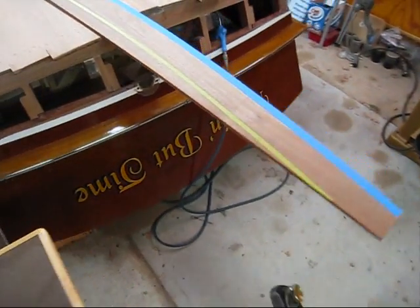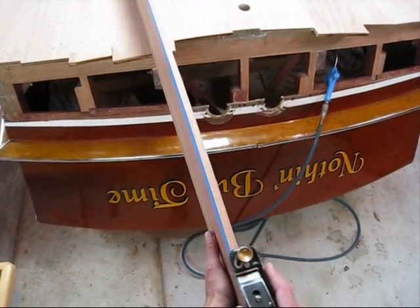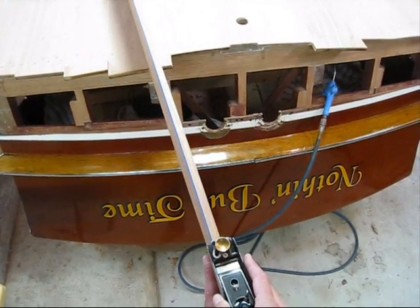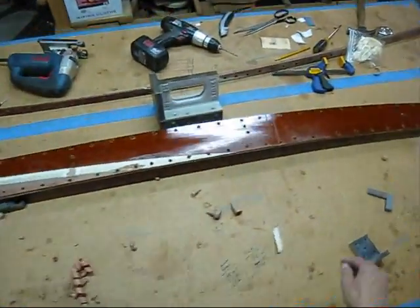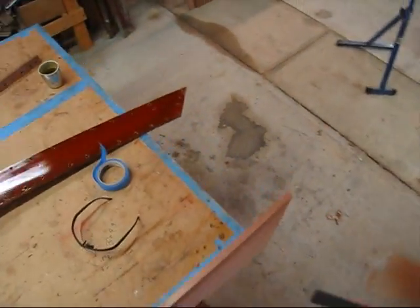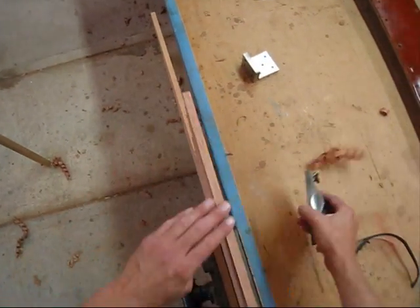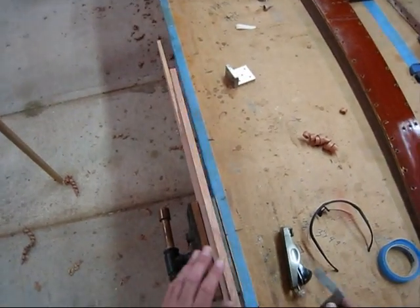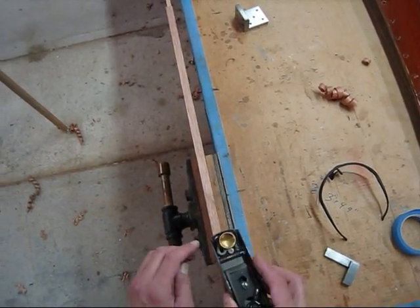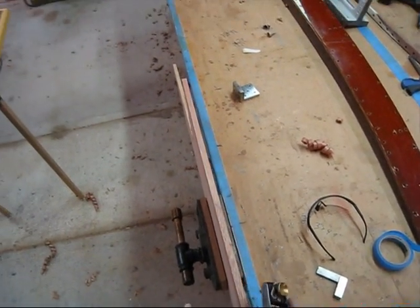Before I get into that, I'd like to mention that when the piece of wood will work with me and I can use a hand plane — which is most of the time with mahogany — I like to use it and just freehand it. If you do that enough you'll get good at getting the edge 90. What I do is keep a machinist square with me, and if you're conscious of how you're holding the plane, you're usually pretty good at it. If I'm a little bit off, I can concentrate on one edge or the other to get it square. So it's a good idea to learn how to do it freehand just so you get practice at it.